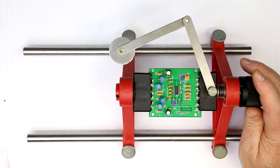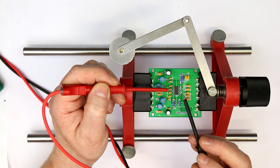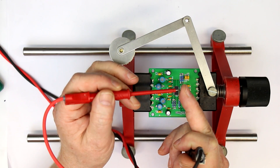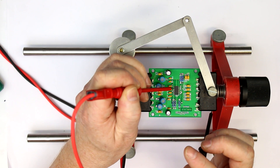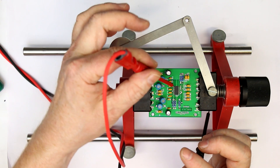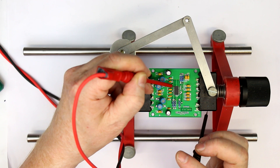And for that purpose, as you have often seen in my videos, I usually use these ultra sharp probe tips because it's always important to poke through the oxide layer. That's the reason why they have to be as sharp as possible. The other advantage is that without too much pressure they are simply holding even on IC pins with very small distances.